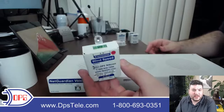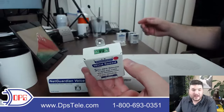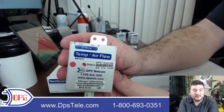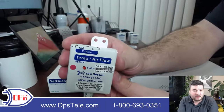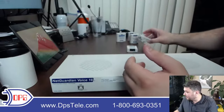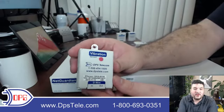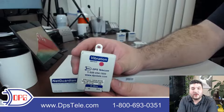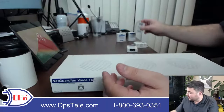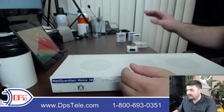The D-Wire sensors do all sorts of things. This one measures wind speed with an external anemometer — good if you've got a helicopter site. This one goes on an HVAC vent to tell you temperature and airflow, letting you know if your filters are clogged. There's also a vibration sensor to put on a generator to confirm it's operating. There are a whole range of different D-Wire sensors; this is just a couple.